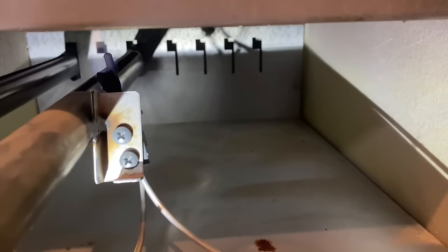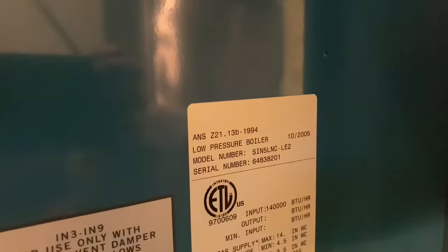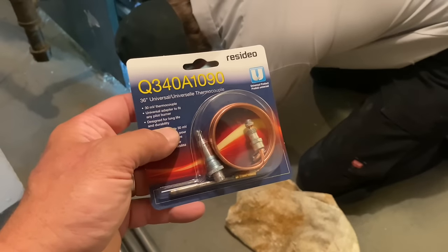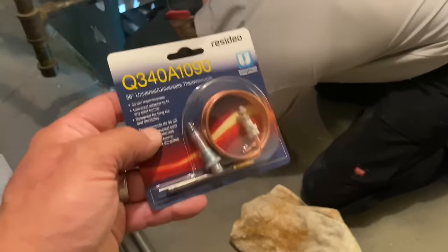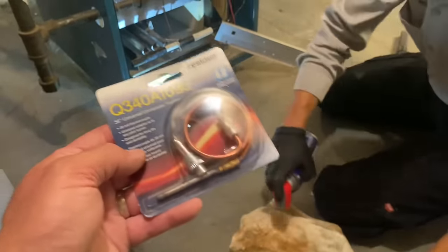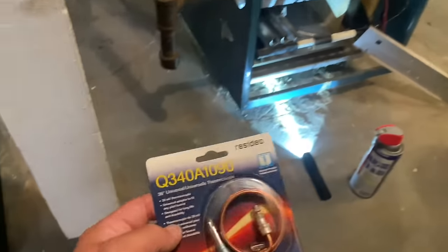The hardest part on these Weil-McLain burners — you have to get that back piece into that little notch right back there; see those little slats, you've got to get that in perfectly. One observation: the thermocouple is definitely the original one from 2005, so it's a small price to pay for an insurance policy. I'm using the Honeywell 36-inch universal thermocouple. I only stock the 36-inch — you'll always be able to use a 36. If you carry the smaller ones, sometimes you may need that thermocouple stretcher.